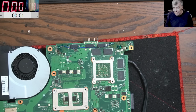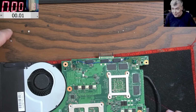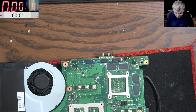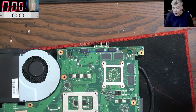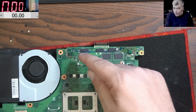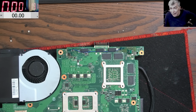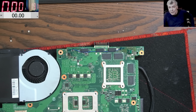Insane. I'm sorry, I got bored and just stopped the recording. I said, it's no point. I don't even know what the problem is. Because every time there was a different voltage, so I started replacing MOSFETs. I started replacing capacitors. Till at some point I realized, wait, the only chip which is working is the original one and the track is broken. Actually, it's not broken. A broken track is easy to find. It was having random resistance. So I'll stop now. Actually, I'll not stop, sorry.